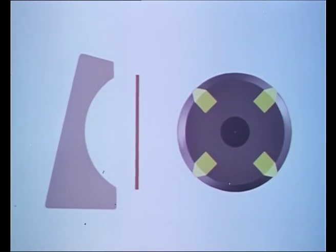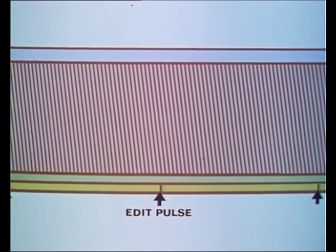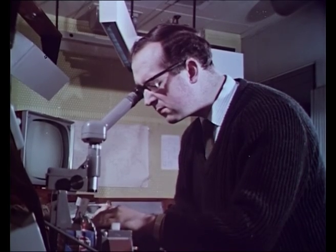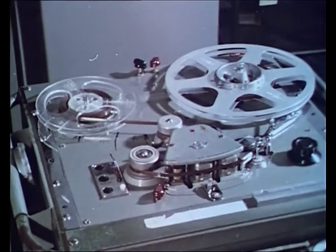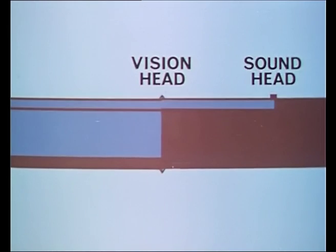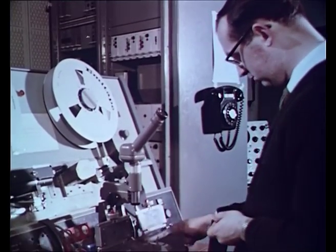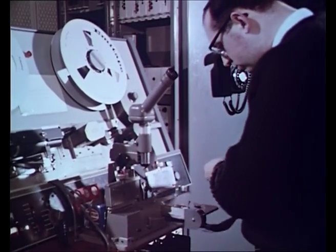This film has dealt with the basic properties of videotape recording. If a program has to be edited, there are certain difficulties to be considered, and it must be decided which method will deal with them most effectively. The simplest way is to make the edit where picture and sound fade to black. If this can't be done, a direct cut gives rise to certain technical problems which can be overcome by transferring the sound by the use of a sound tape recorder. Depending on the type of edit that has to be made, it may be better to prepare a retake in the gallery with overlapping sound. But all these methods will involve the physical cutting and joining of the tape by a videotape editor.